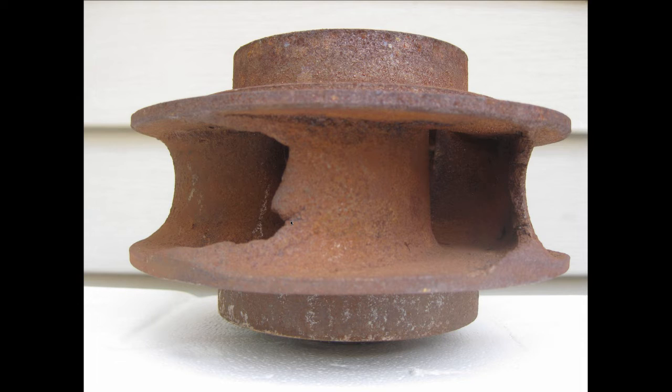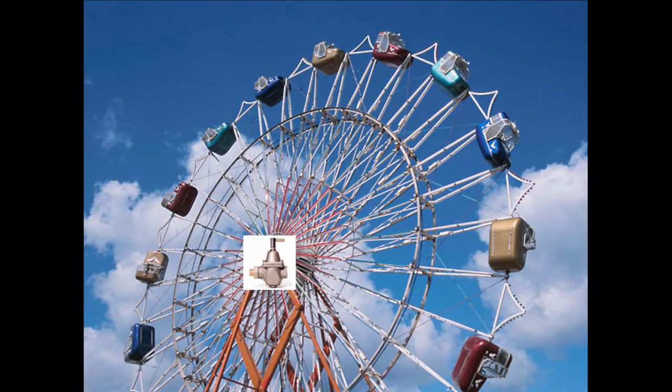And if you want to hear this in real life, if you have a swimming pool, or better yet, if your neighbor has a swimming pool, go over to the pool skimmer there and take a beach ball and just stuff it in while the filter pump is running, and listen to what happens. Because the filter pump is going to immediately begin to cavitate as it throws out more than it can suck in. And if you're lucky, you'll even see the hose going to the suction side collapse as it goes into vacuum. So don't do that on your own house. Do it on your neighbor's.